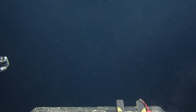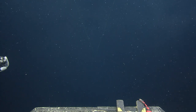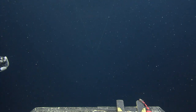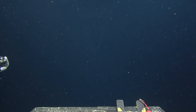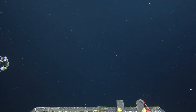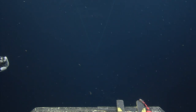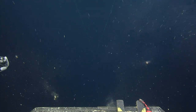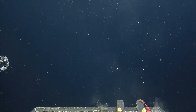2230, you say. I should get a ping on the sonar on this sweep. Yeah, 2210, something like that. We should be facing north, though, right? Atalanta will get it in the aft. I need to spin Atalanta around. Clockwise. Thank you. Horizontal distance is approximately 20 meters. Perfect. Top of the hour, a good time for gauges. There we go, we've got a target. Looks like 20 meters out. I don't know why I didn't do this before. Range down a bit, 50 meter. So Atalanta's 10 meter divisions now. It should light up a little bit. There we go. See it there?